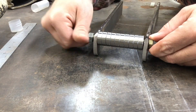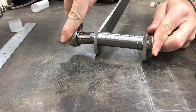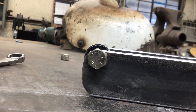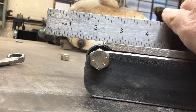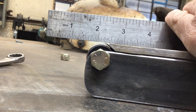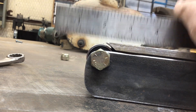As I assemble this, all I'm doing is running this bolt through the hole. The hole I made is 3/8ths, so it's a pretty snug fit. This bolt doesn't really have any wobble in that bolt hole, which is what you want. When you tighten it down, it's going to make those two pieces of quarter by inch-and-a-half parallel with each other. The top plate is quarter inch also, and I made it just a little bit smaller than the outside measurement on those pieces — just a little bit bigger than the bearings stacked together. I think this thing is about 3 inches wide.